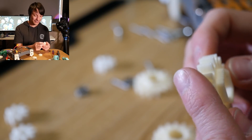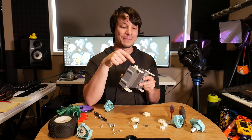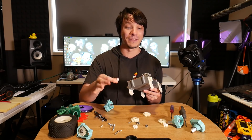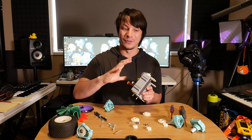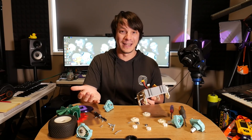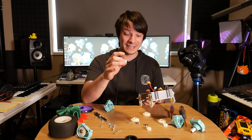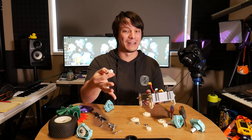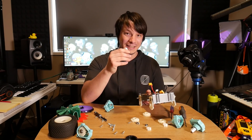It's really the teeth I'm interested in and they just seem fine. This one pinion gear is very telling - it's the only pinion gear in the whole thing that is ABS. All the others are the Pro 1 PLA that I found to be very tough and strong, but this ABS pinion gear has started to deform on the D shaft of the gear motor, which tells us it's not as durable and long lasting as PLA. A lot of people are concerned about these melting, but at least in the low speed application that this output gearbox has, I don't ever see that occurring.